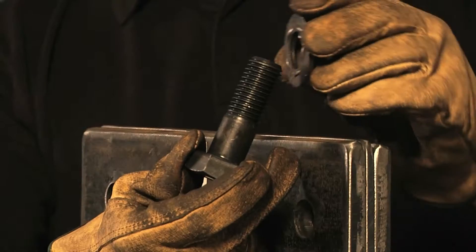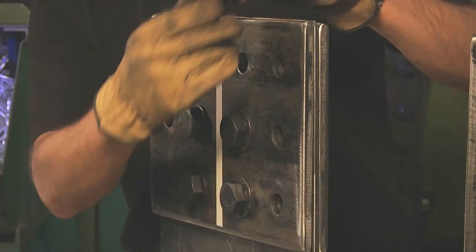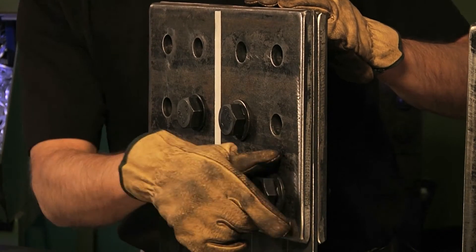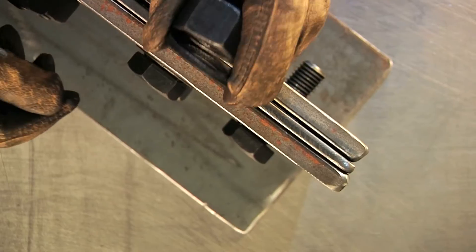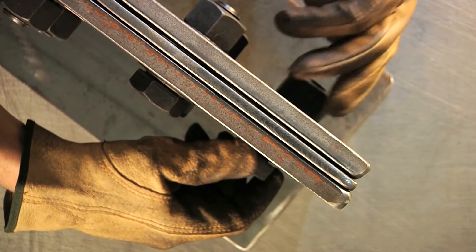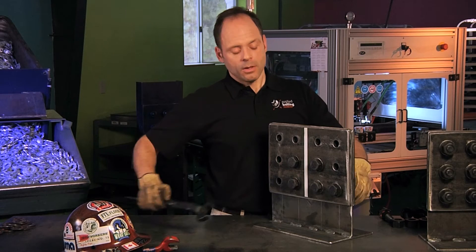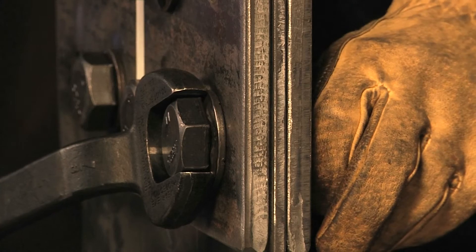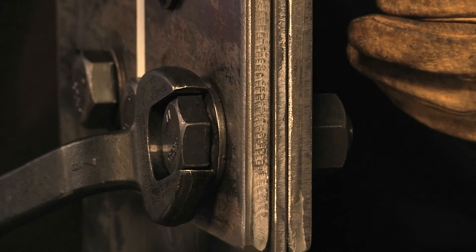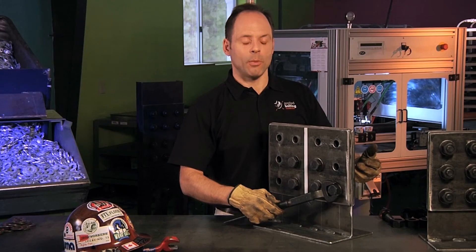So let's do that. We have the bolt threads up, DTI bumps into the bolt head, insert the bolt through the steelwork, flat washer and nut on the threaded end. From here, we're going to have to put a spud wrench against the bolt head to keep it from turning directly against the DTI bumps, and someone's going to advance the nut to induce the bolt tension.